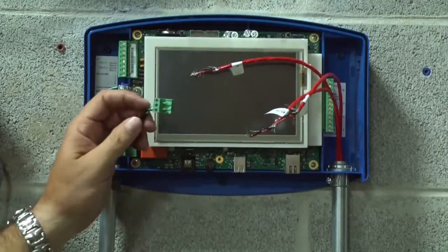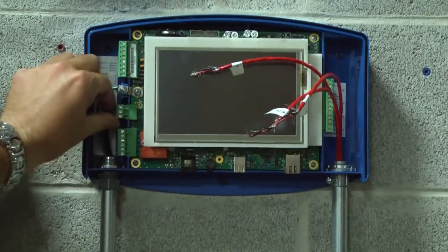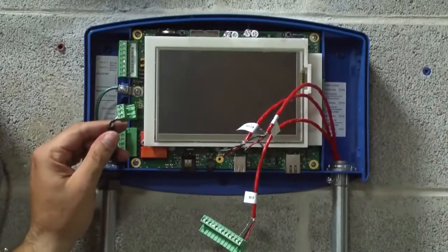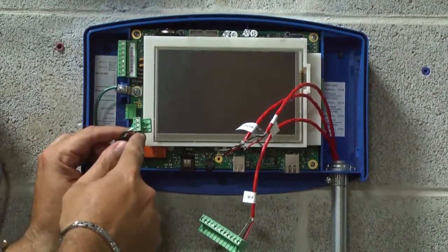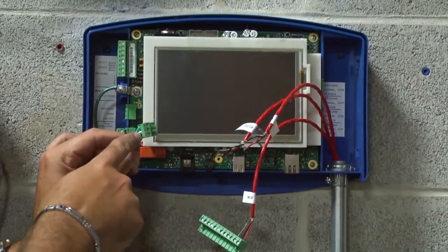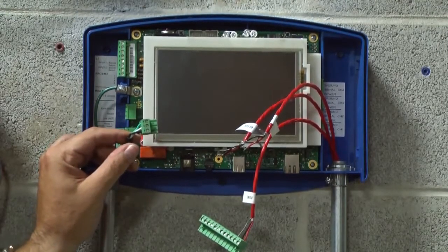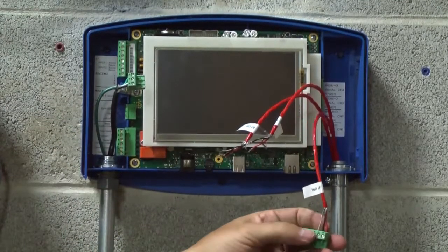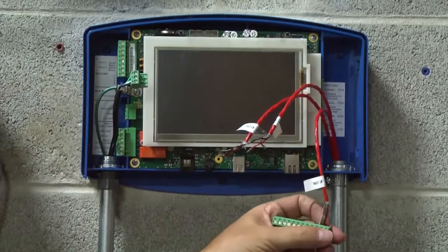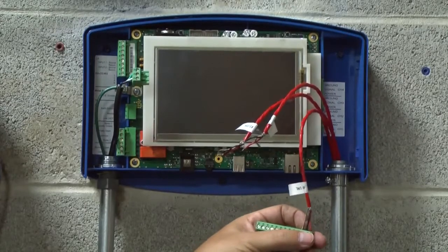When wiring up the electrical, you can remove the connector, wire it in the connector separately, and then install it back into the console — this makes it easier. When stripping the wire back and slipping it into the connector, make sure that no exposed wires or wire threads are going from one terminal block to the other. You can short out the high voltage, and on the intrinsically safe side, stray wires going from one connector to the next can short out the barrier or damage a connected probe or sensor.